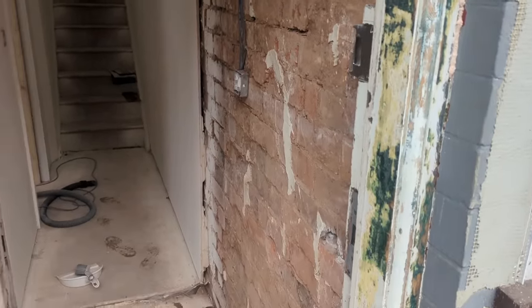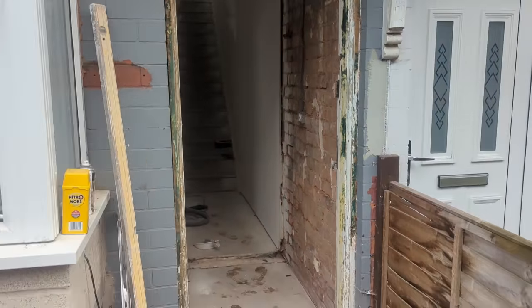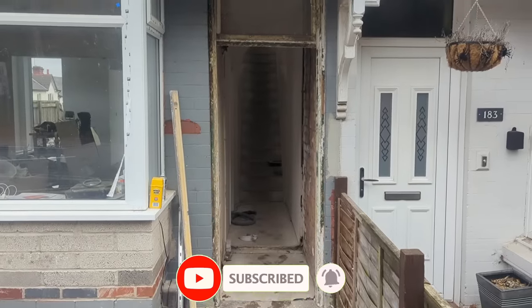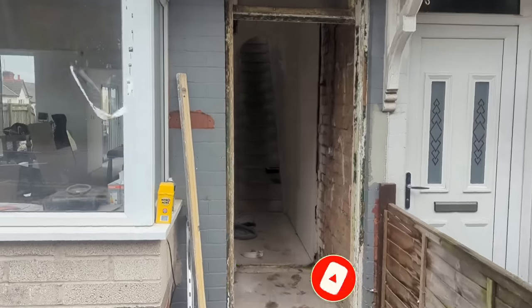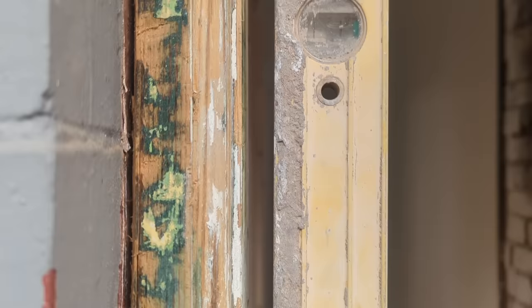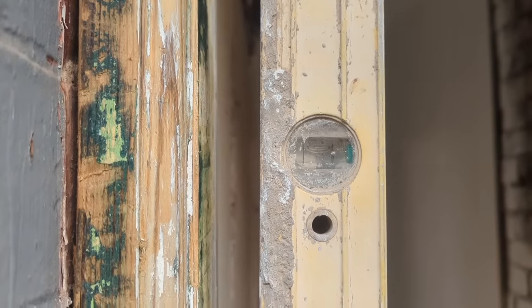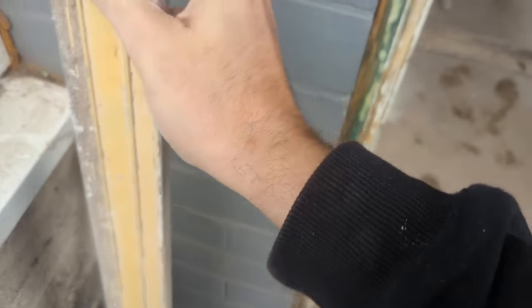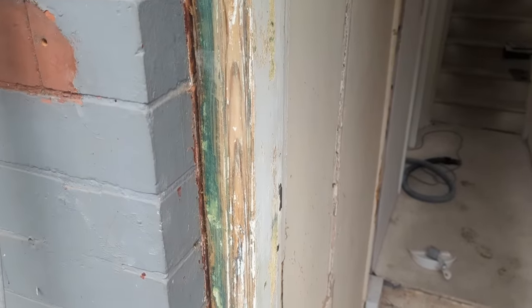The reason I'm not having a new frame — look how much that frame is out of plumb. It's amazing. The house is fine — we're an end terrace, over 100 years old, the gable was lovely and plumb — but that frame is significantly out. There's no way a new frame can be fitted into that of any real quality. So we're going to keep it and put a reclaimed door back in it. Over to Richard.